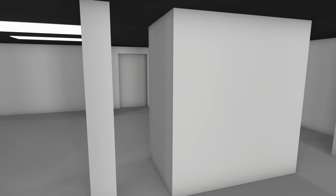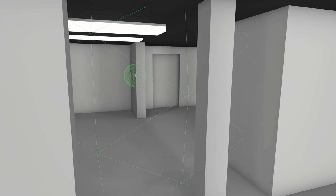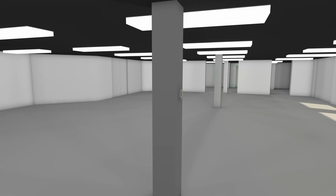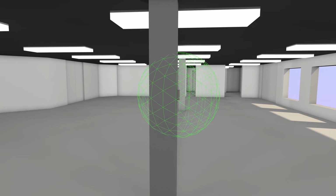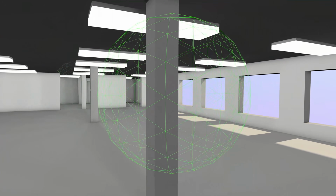Wireless installations often require some thought and testing to ensure best and long-term performance. Consideration should be given to the placement of the sensors relative to the gateway, as well as what comes between them. Signal strength decreases the farther it travels and as it travels through different materials. Let's review a few factors that impact wireless performance.